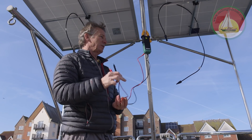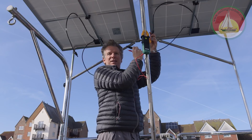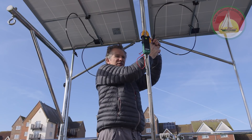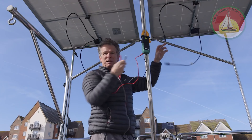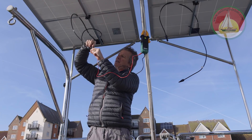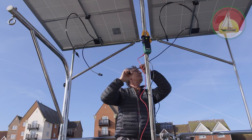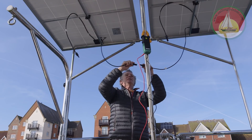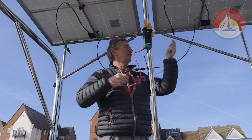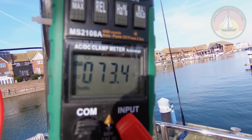Just before the final connection I'm going to make sure the panels are working as I expect. The female connector is the positive. I've got 35–37 volts across that one — about right, that's what these are rated at. I'll check the other one: positive is the female, negative is the other, and that reads 36.9 volts. So they're going in series — I'm connecting the positive of one to the negative of the other — and across both together I've got 73 volts, so that's all looking good.